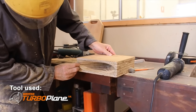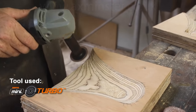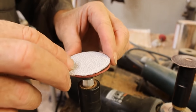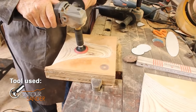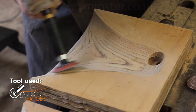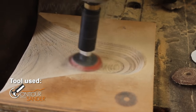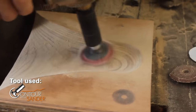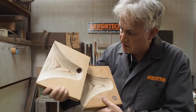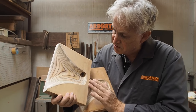You may need to bring the two sides together and just check for alignment — you may need to just adjust it slightly. First I'll use the sander from the mini turbo because it's very good for rapid fine shaping. And then I'll use the contour sander for doing my fine finish using the random sanding action. I've finished sculpting and sanding the insides of the speaker. You can see that you can check your symmetry as you go in because the contours reveal themselves as you go, so it's quite easy to do that.